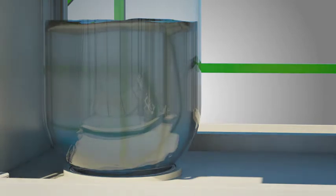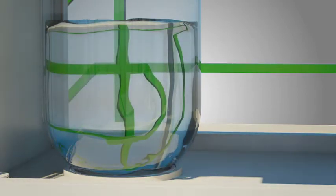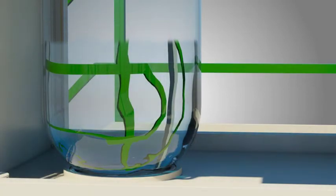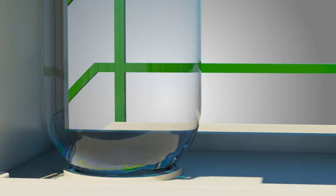This bed formation increases as circulation proceeds, and the solution gets more and more clear as gold gets precipitated. Formation of the bed enhances the filtration efficiency, acting as a filter aid in the process. At the end of the entire gold being filtered, the liquid can be viewed as completely transparent, bluish to greenish, depending upon the other impurities present in the alloy. At this point, the solution is transferred to storage tanks for recoveries of other metals and wastewater treatment.